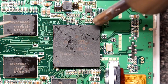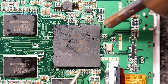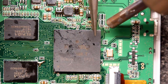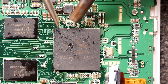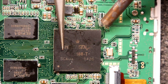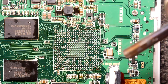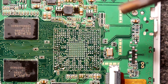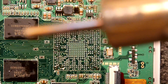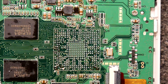The tweezers are nice and warm now — I just removed them just in case they were acting as a heatsink. I've got my hand resting on the battery of this unit and I can tell you the battery's hot — it really is sinking the heat everywhere. This PCB, if you're ever going to do this realistically, you really have to unscrew this whole thing. So there you go — that's the ball grid array. Let me turn off the fan. If you've got one of these blowers, run the fan to cool it just to let the nozzle cool down — you'll preserve the life of your heating element significantly doing that.